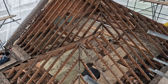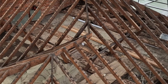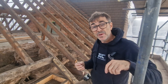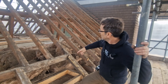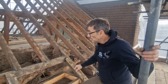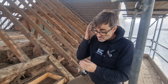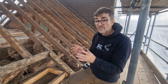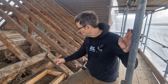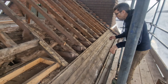At the front intersection you've got a hipped bay with a valley as well, and it's much less engineered than we'd do nowadays — we would now use a 150mm rafter for this sort of work, whereas these are 100mm. That said, this is really good quality softwood, like a redwood. If you looked at the annual rings and compared it to a new piece it's incredible — it's got a real nice tight ring so it's probably much more solid than new 4x2.